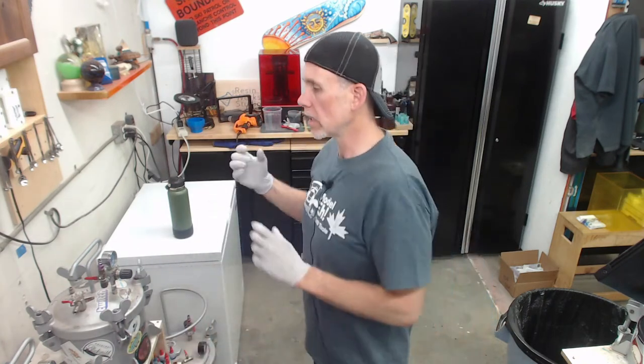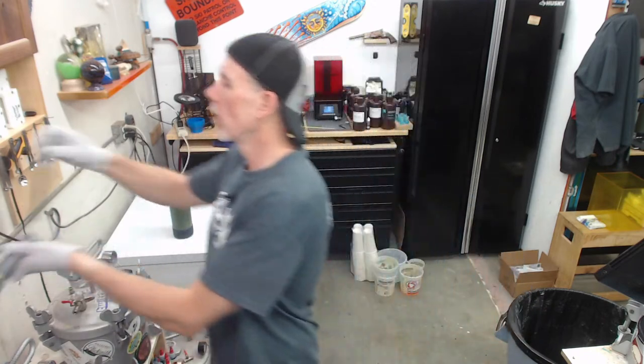The problem with that, for your case, is its super thick viscosity. Especially when it's cooler in my shop, it's like mixing up molasses, really. I don't really recommend that, because it's really difficult to stir it and not introduce a bunch of air bubbles. So the thinner viscosity ones are, I find, a little bit better for that kind of situation with no pressure pot. All right, so hopefully that'll help out a little bit.